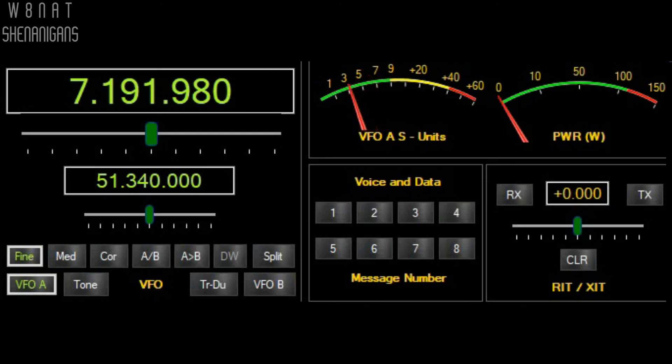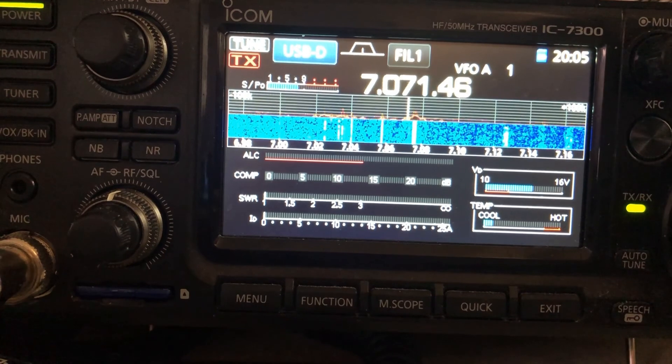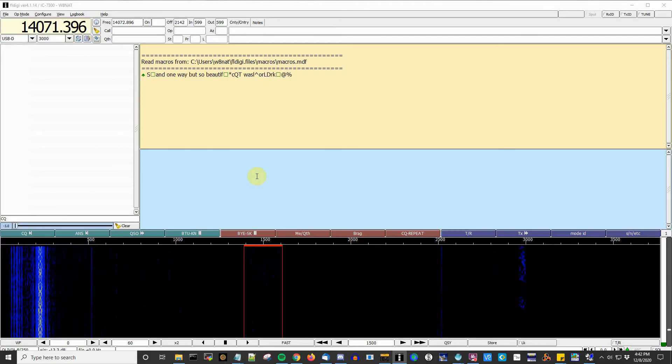WSPR aside, how about the practical world? The first thing I noticed was on the receive side — this antenna is 10 feet lower than my end fed, and I get better signals in a lot of situations. The big one on the receive side is that it's a much quieter antenna. Here's 40 meters on my radioscope complete with background noise, and here with the doublet. On more than one occasion this has made an audible difference that made a sideband contact more readable. Where this really shines is when doing chatty digital modes. Here's me looking at an Olivia signal in FL Digi — I can't see the Olivia and it's not even decoding. Switching to the doublet, now it's starting to show up, and it looks even stronger when the PSK signal goes away. That's some automatic level control shenanigans right there.